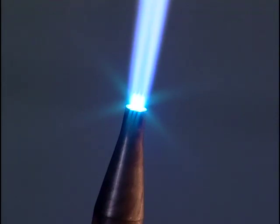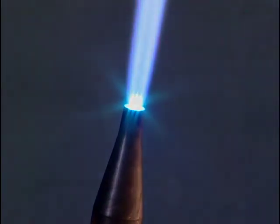But when you are cutting, the preheat flames should be neutral. A neutral flame is important for a good, clean cut. There's not a preset distance. Different thicknesses would cause you to regulate that heat setting. That's experience, but I think the best way to adjust it is by eye. Someone has to train you and teach you the proper way. You'll know when you're not doing it right, when you can't burn.